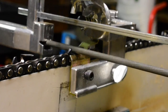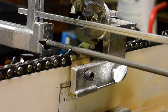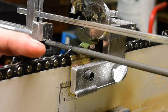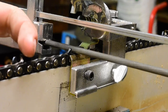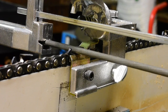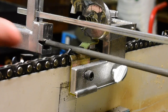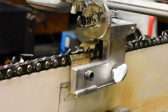To start off with, I'm just going to set the tooth length just so I file off enough of the tooth. That way it's straight across. The top plate angle is straight across at 0 degrees. I wanted to set the depth just so that I've filed just enough to get the entire face of the front of the cutter